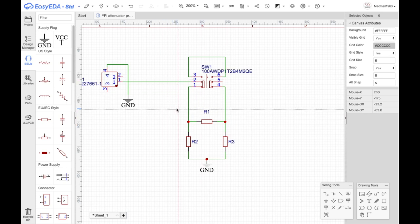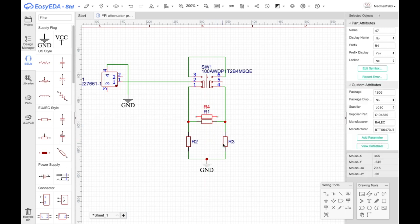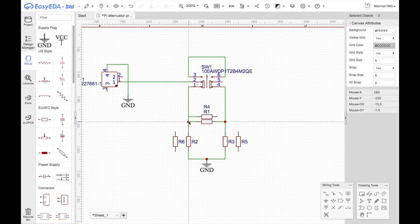And what I'll be doing is creating a whole number of these modules. Each one is one attenuator. Now, the one thing I do want to do here is, because these resistor values are sometimes difficult to get exact, I want to create pads for two in parallel. So I'm going to put two everywhere where I have one. And the reason for this is I want provision to be made for this on the board. So I'm basically paralleling resistors in order to easily reach or achieve the values that I want.